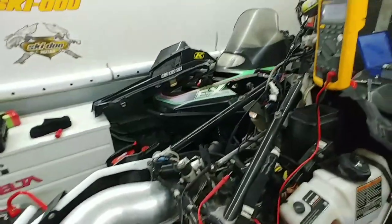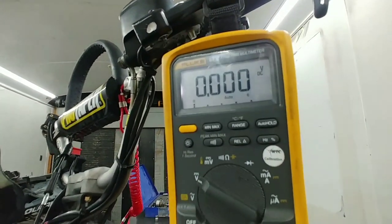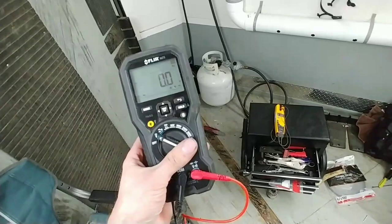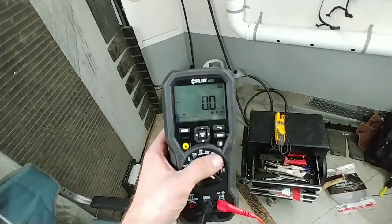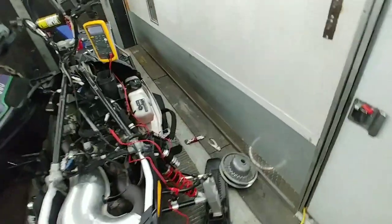To finish this test you need a good multimeter. I'm using a Fluke — I think it's an 87 V True RMS. Not all meters are made the same. I originally grabbed a cheap demo meter off my office desk thinking it would be plenty, but it turns out it doesn't measure millivolts in DC, which makes it useless for this test since you're looking for 0.7 volts.